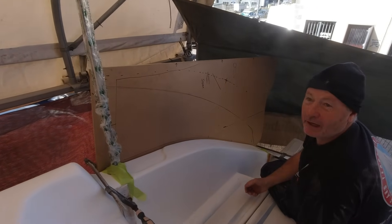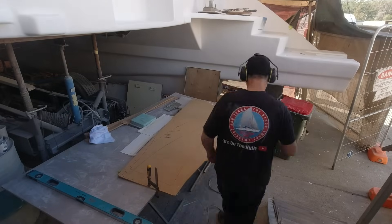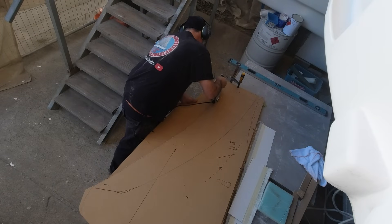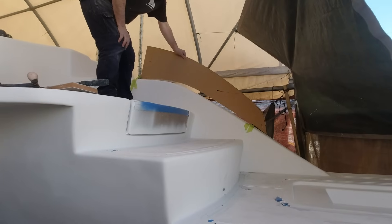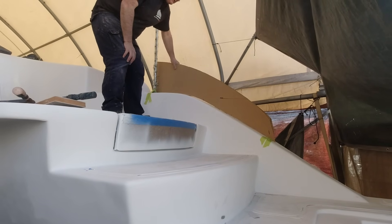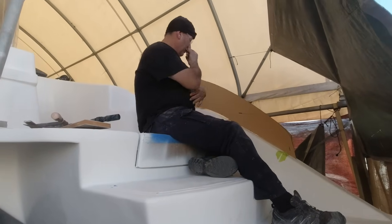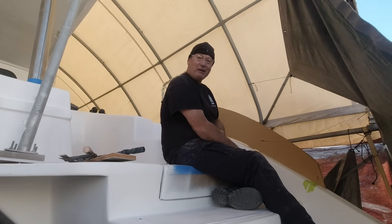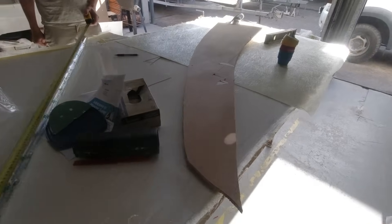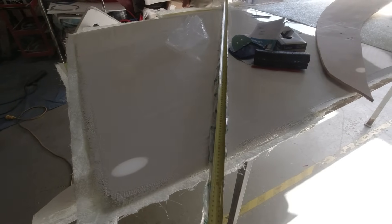Whether we put in a vertical is a matter of how strong it looks once it's all welded together. I'll use this MDF as my mould, cut it, bend a form onto it, and push the pipe against it to get both sides exactly the same. We've got a template here for our curved handrail and an offcut from our last effort — about 1910mm. We reckon this offcut is about 1760mm, so we've got about 12 centimetres extra, which is good.